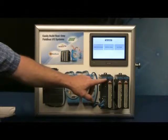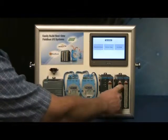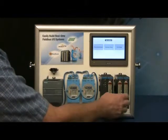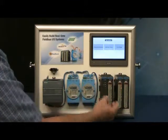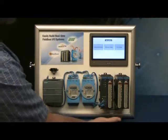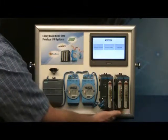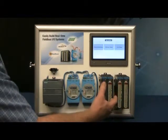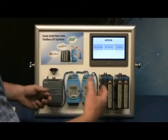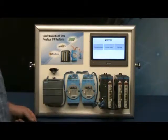Finally, we have the APEX 5071, which is running some remote I/Os — you can probably see the lights flickering. Also, we're showing on this backplane here that it's separated and connected underneath with an Ethernet cable. Even though it's connected with an Ethernet cable, it's still treated as part of the backplane. So this setup can work either way, and the customer wouldn't have to do any additional steps to set it up.